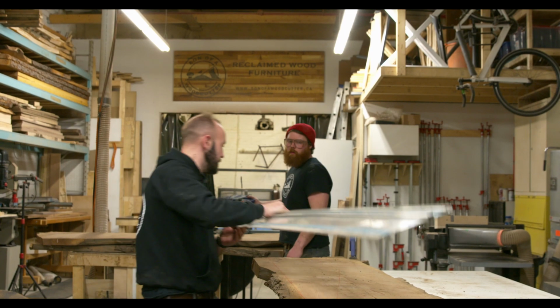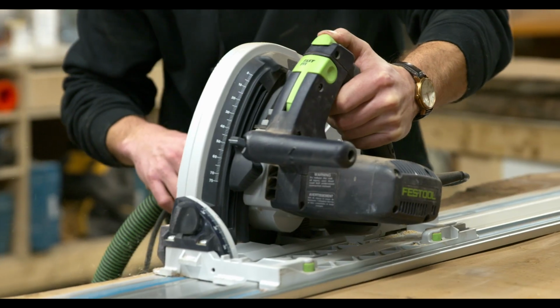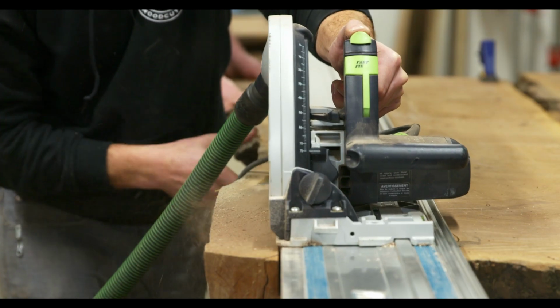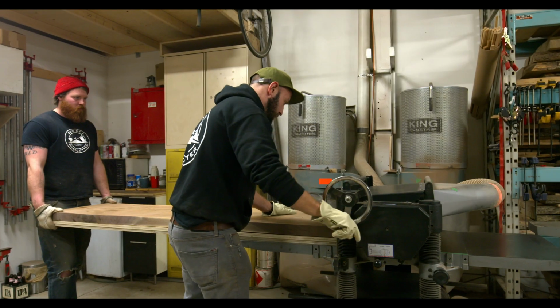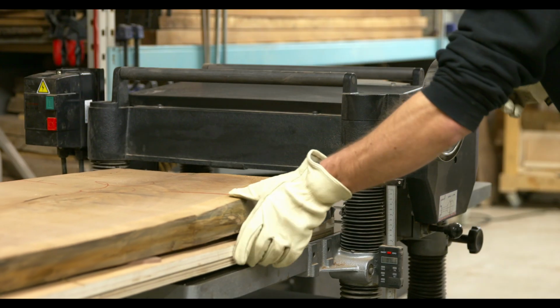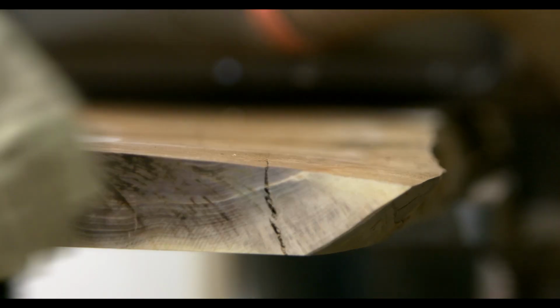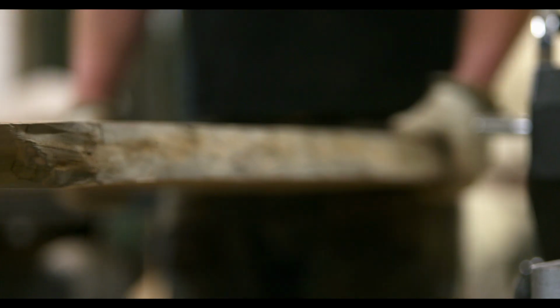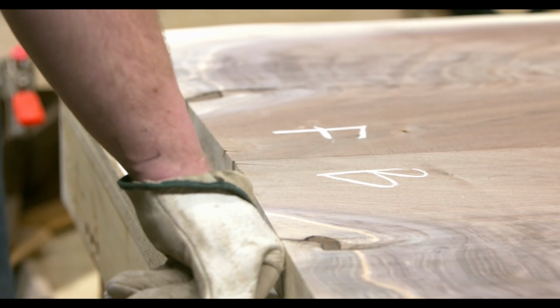The build process continues once the wood's been kiln dried, that gets rid of all of the bugs and takes all of the moisture out of the material. Once it's been dried, it's quite often warped or twisted slightly. We try and avoid that as much as we can during the drying process, but the wood will do whatever it wants to. So then it will be flattened in a planer. The planer is about 20 inches wide. It's fed in on one side, which will flatten it perfectly, and then you flip it over and you pass it through a good 3 or 4 times, and then it will flatten both sides perfectly. And then, and only then, can you get a perfect joint.